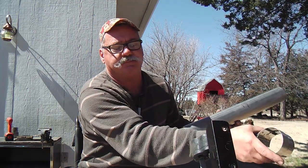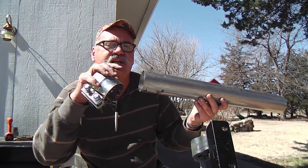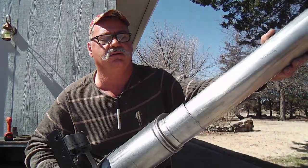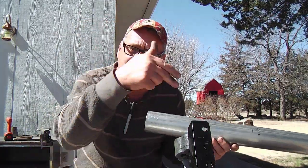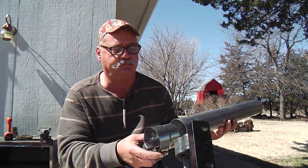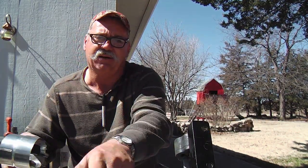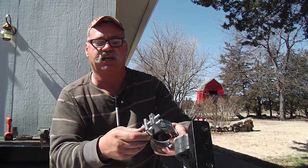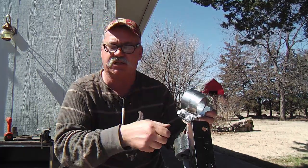Okay, and the 3-inch inlet tubing will really be more than that. It'll have a 3-inch inside diameter. So you see that they fit in quite well. So don't worry about whether it's more or less on which end. If you get 3-inch tubing like this, it'll go into a 3-inch muffler outlet. And then these clamps, I like these Walker clamps better than others I've seen on Amazon, because they have the threads built in. There's not a nut on the other side, so you don't have to worry about holding it behind. It's just one wrench and it'll do it.